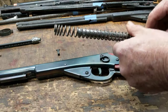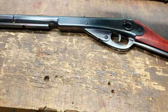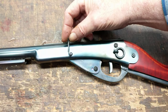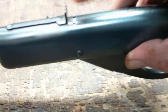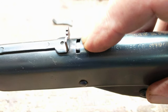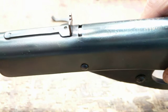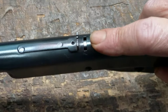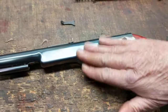In one regard they're easier to install than the standard spring anchor style mainspring because there is no spring anchor. You'll notice that this little piece, which is an integral part of the Daisy design, is not in this gun because this gun's been converted to a model 40/27 with a sliding spring block. What we're going to do in this video is show you how to dismount and mount your sliding spring block, because you have to put pressure on the mainspring to get the lever installed. That's the purpose of the video today.